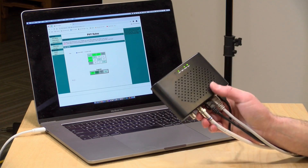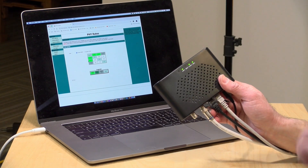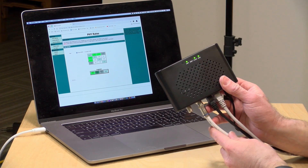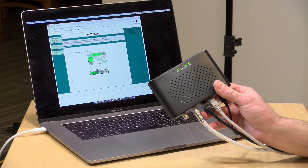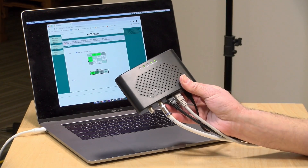These devices don't add much noticeable latency — maybe a couple of milliseconds. For most folks, including gamers, that added millisecond or two is probably not going to make a big difference, especially given how much more reliable the connection will be. At the end of the day, Ethernet is best, but MoCA is probably next best for extending your network, and you likely already have the cable wiring in your home. If you're not using your cable wiring anymore but still have it, you can run MoCA without any other cable TV connection going over those cables — I do that over portions of my home right now.